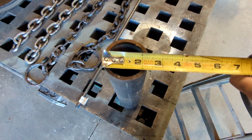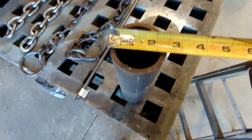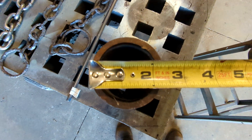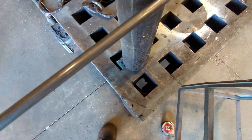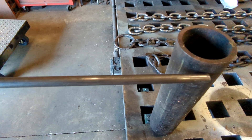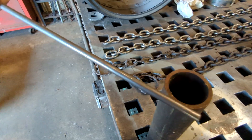I was pretty quickly able to find a piece of pipe that'll fit the bill. The outside diameter is about two and a quarter. My next step is to take this piece of pipe and tack weld it, then take my torch, start heating this, and slowly bend it around — and you'll see how I do that.